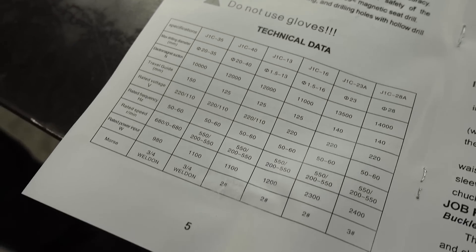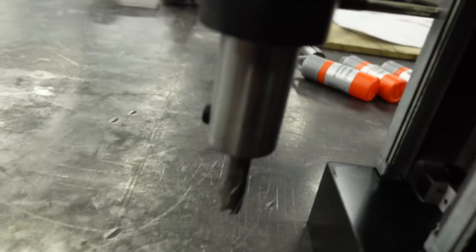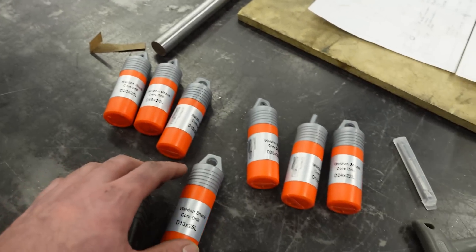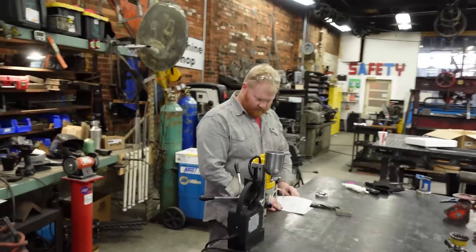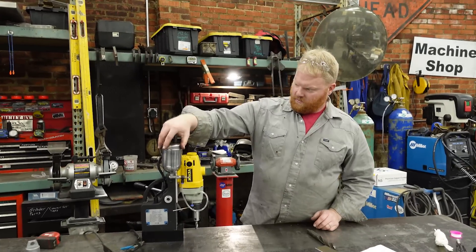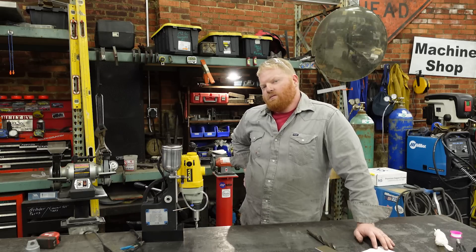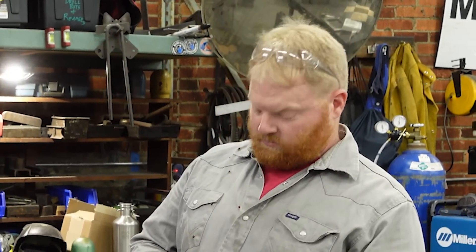Here's one of the parts — all my cutters. So these are all the cutters. I put a 12 mil in here and it looks like it goes up to a 27 mil included, but it should be able to cut up to 40 apparently. I need the 27 for something else. 'Do not use gloves.' That's fair advice. Well, there you go — magnet works. Let's try to drill something. I wonder how cutting oil versus regular automotive oil differs — there's a big viscosity difference.